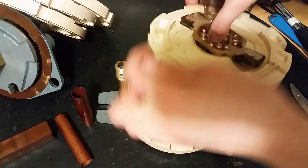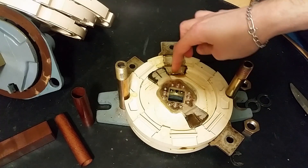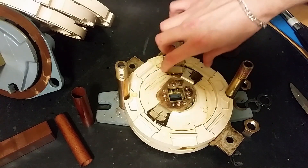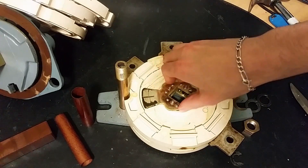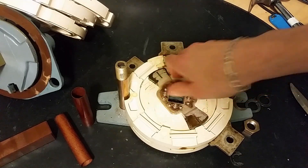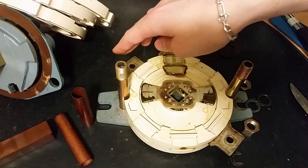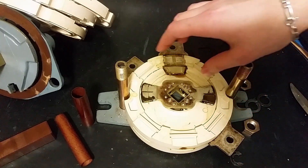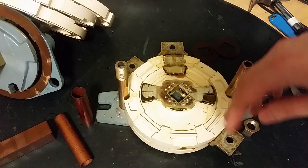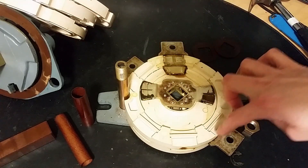The brush is here now in that position. When this goes in, power goes this way. When we rotate it out, it turns off — no power output. Rotate more to connect to the other terminal. If this is an AC source — one from the generator and one from the mains — you don't want to connect those two together, as they can end up very badly if they are out of phase. That's why you always have an off position before connecting to the other one.